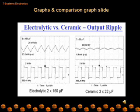For example, we have taken an SMPS design to see the effect on the output by first using an electrolytic capacitor and then a ceramic one. From the slide it is clear that when an electrolytic capacitor is used, the output waveform is a triangular wave instead of a sinusoid. This is because at 692.48 kilohertz, the electrolytic capacitor behaves like a resistor, producing a ramp waveform rather than acting as a capacitor.